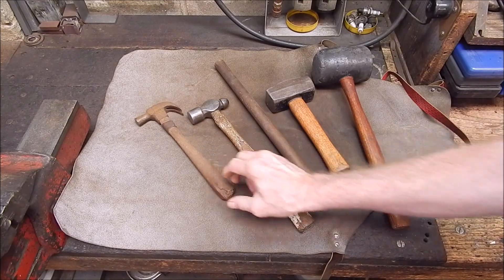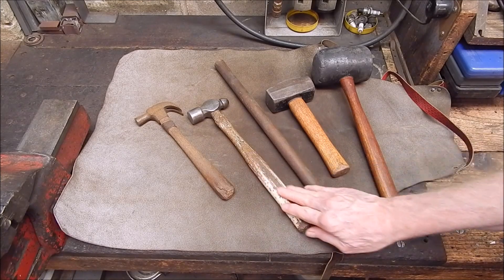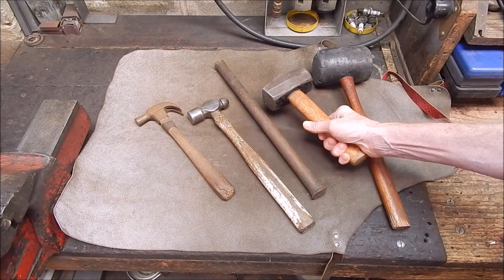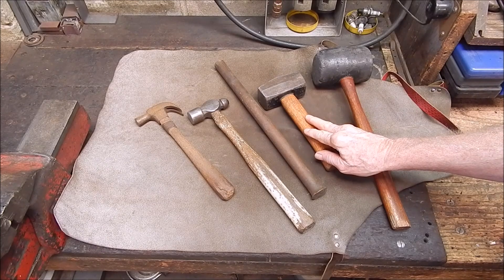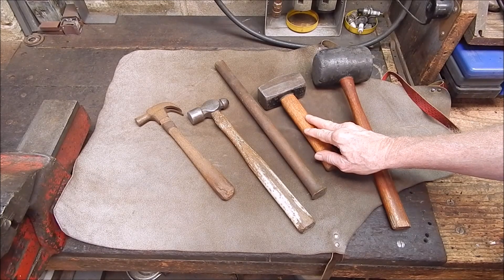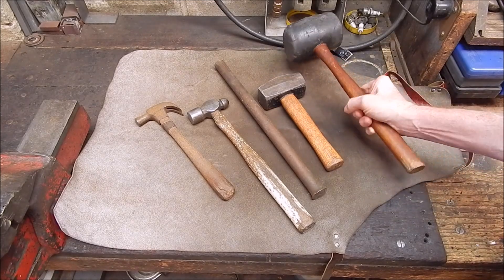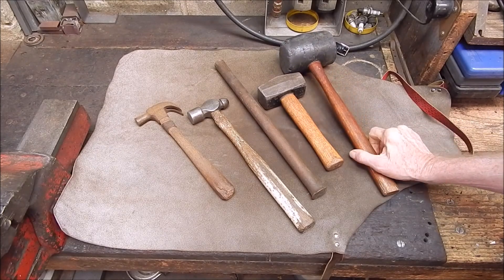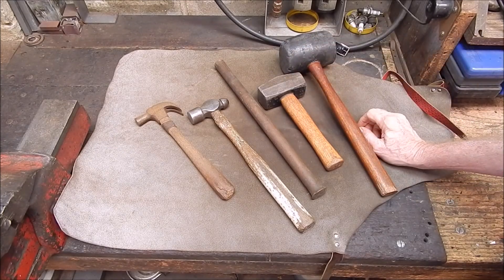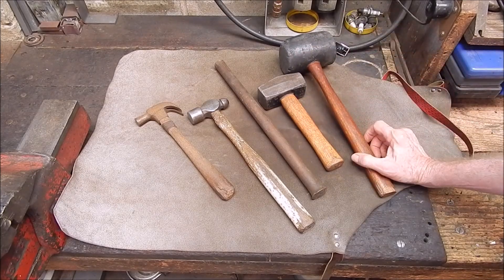You can see I don't do much woodwork. You've got to have a ball-peen. And then when you want to get brutal, you've got a small sledge — you can use that for cold chisels and impact drivers and stuff like that. And then if you want to knock stuff out and not damage it, you use the old rubber mallet. They come in all sizes — this is a big one. You can do tyres, get tyres off rims with that. They're pretty bouncy, springy things, and even though they don't damage the job, they bounce off. They don't really work brilliantly on stuff that's frozen.